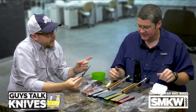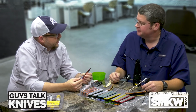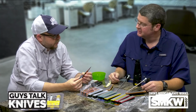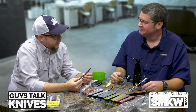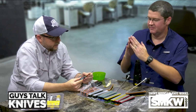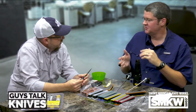So the one thing that I think I've done wrong using this kind of system was continuously checking for that burr. Pretty much, that's great to know. Check for it for the first, that's a great tip, because it would concern me that I wasn't getting that burr, and then I was probably taking off too much material at that point, instead of really paying attention to the scratches like I should have. Because if you think of how much you're having to affect that metal to actually get it to curl over, you're not going to do that once you get into the final.